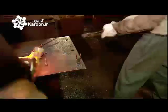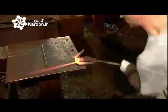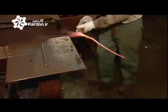With 2 tines now shaped, his partner bends them out of the way so he can work on the 3rd one. Rolling takes 18 months of training to perfect. If the tine isn't precisely aligned with the grooves, the equipment could seize, causing possible injury to the worker, and the dies would almost certainly be damaged.